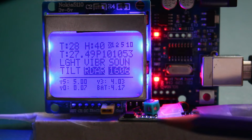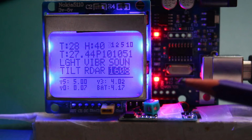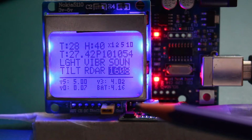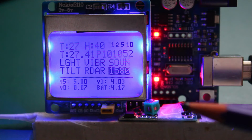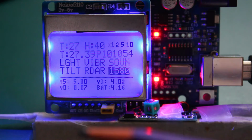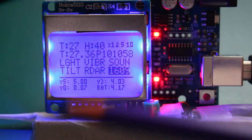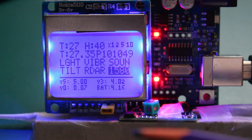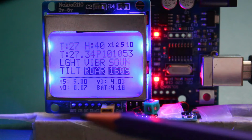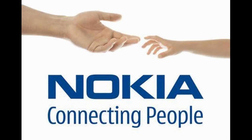This is the receiver here, attached to an Arduino UNO. And this is the structure I already mentioned before, with a dipole configuration antenna. This is directly connected to the Arduino UNO without cables. So I just reconfigured some pins. Two of the pins are the ground and the 5 volts that this board needs, and the other is the data. I did the same for this screen. I wanted this to be the most compact project possible, so I'm not using breadboards or cables or anything. I plugged all the pins of this Nokia 5110 directly to the Arduino UNO.